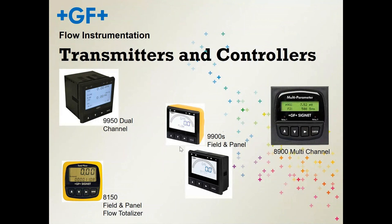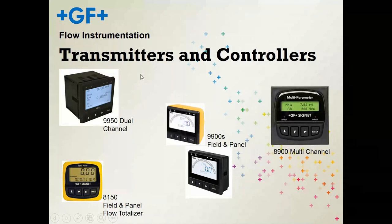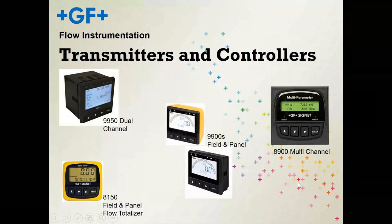One of the things that works definitely in direct concert with our flow sensors would be our transmitter line. We have a number of different transmitters that we can choose from. We have the 9950 dual channel, so you can take two sensor inputs into this unit. It is a multi-parameter unit, so it doesn't have to be flow. It can be pH, ORP, conductivity, etc. The 9900 is a single channel. So if you just have a single sensor and you want to bring back and have local readout, you choose either the field mount or panel mount 9900. The 8900 is more of a workhorse unit. I see this where you can do six inputs in and you get four outputs out. And then we also have our 8150 field and panel flow totalizer down here at the bottom, as you can see.